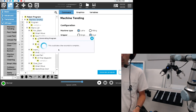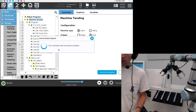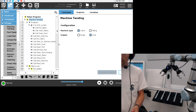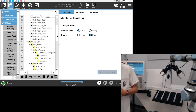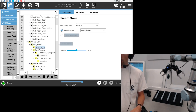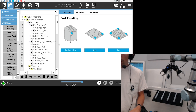The program is split into two different sections. The top section is the execution, where basically the program is executed. The bottom part is what we call the macro list — it's where we're going to teach the actions of the robot in each macro. For example, 'pick blank' is a macro, and in each macro you will have a smart move motion and a specific action.